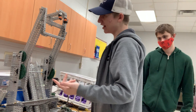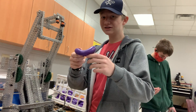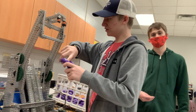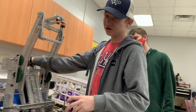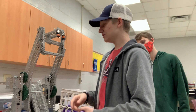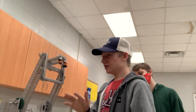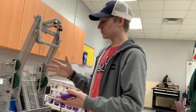If I could have done that, I would have solved a problem where if the ring is oriented with the lip down while going up, the conveyor belt would catch it and swing it straight down so it would just go right underneath the pole. That was one of the problems we had with scoring and consistency early on. I thought if I had a conveyor belt on top, that would fix it.